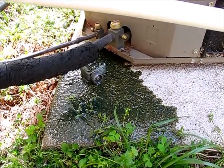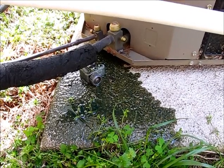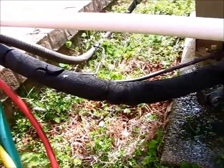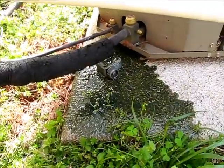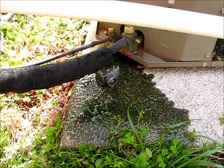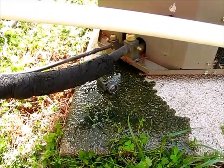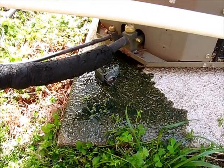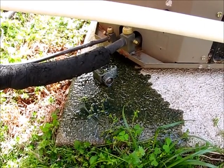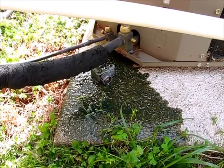and the result is that attacks the copper components within the compressor. This green oil is formed through that process from the dissolved ionic copper compounds that are basically soluble in the oil. Green slime comes from the water hydrolyzing copper compounds, forming copper hydroxide, that forms a grease-like material with the oil. Translated, this unit's in really bad shape and it's going to have to be replaced and thoroughly cleaned, so that's what we're going to do.